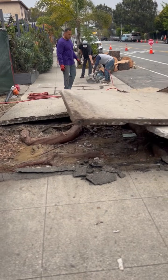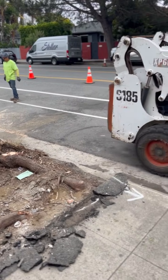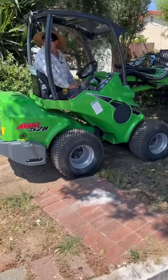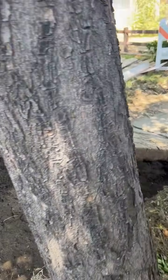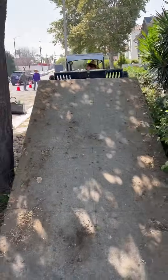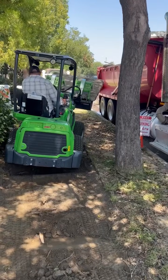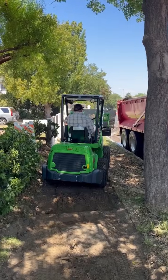You also need rebar in structural work. By structural work I mean if you have a big parking deck with concrete slabs, or a big concrete grade beam that's overhead - you need rebar in there. If you do have cracks or three sections for instance, if you didn't have rebar, the section in the middle once it dropped out the rest of the beam would collapse. But if you have rebar in there, it holds those pieces together so they don't fall out and it maintains most of its structural integrity.